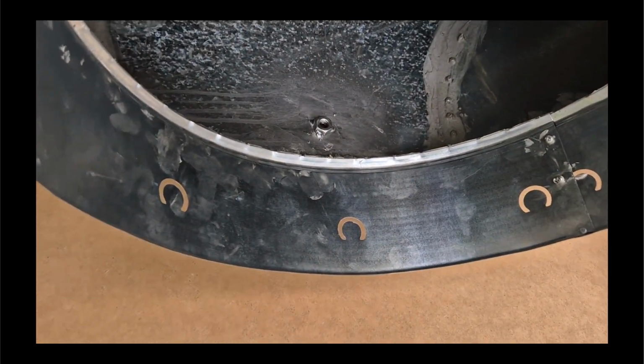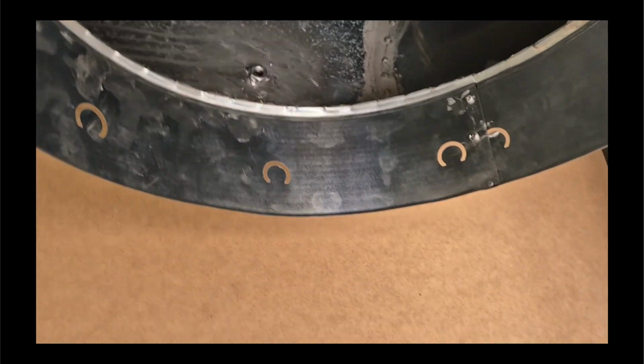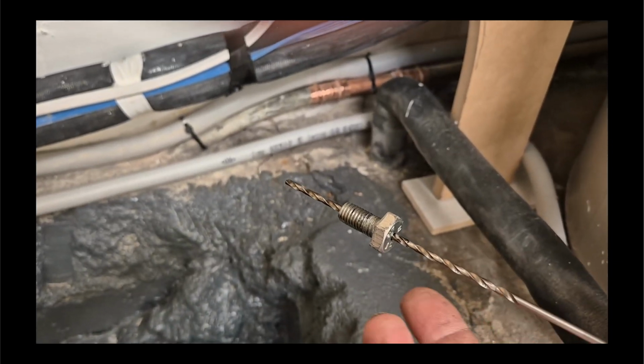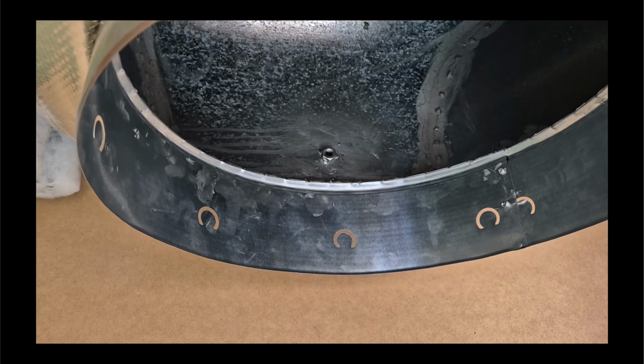And this whole unit is actually sitting in here very solid. Can't really move it at all, but I do have a nut there which I want to put through the MDF for the return side. And I just use my lathe to put a hole through this bolt, and so that means I get a good guide for drilling through to get to the right place on the other side through the MDF.